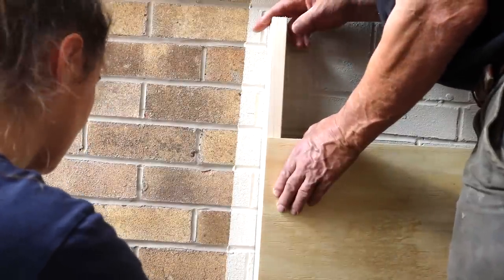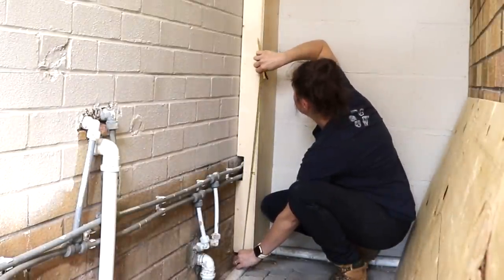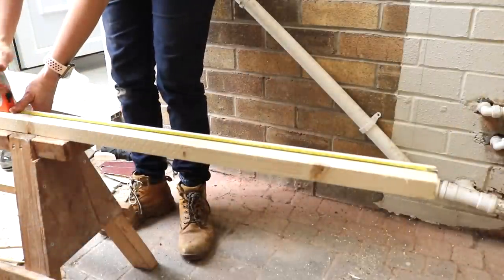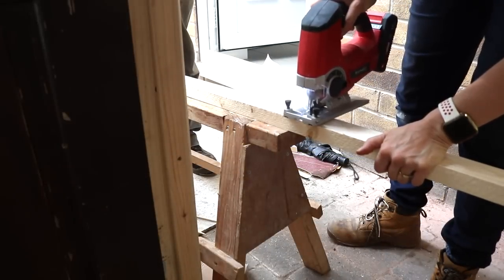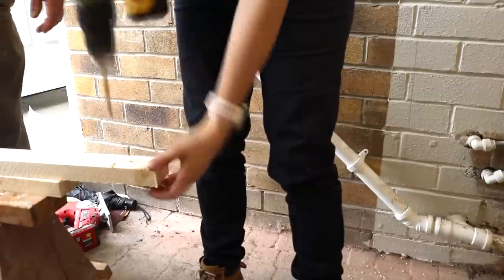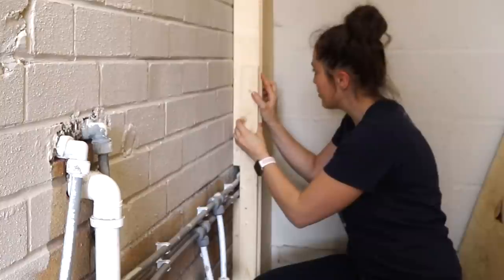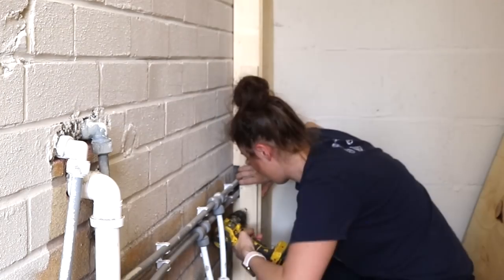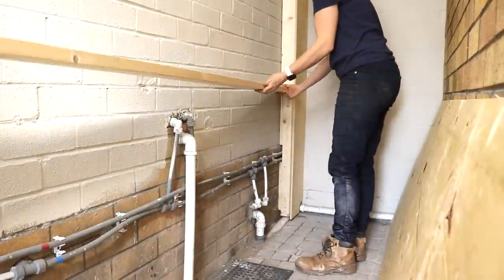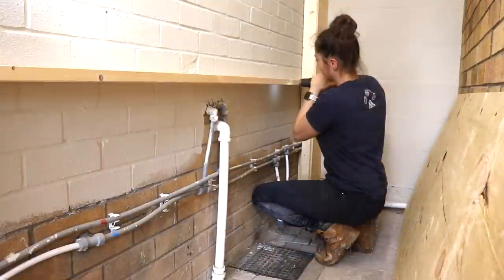This section also needed a frame. For the far right one, I measured from the top of the pipes up to the bottom pencil line and took off another centimetre, which told me how long to cut a spar down to. I just used what was closest — a jigsaw — so that cut would be facing the floor. Then I held it level with the framework on the right-hand side, not level with the plywood at this point because we need to add that after, and screwed them together. Then another length goes on top of that, in line with the long reference line, propped up with another piece on the opposite side, and more pre-drilling and screwing.